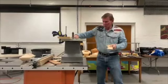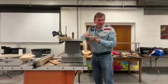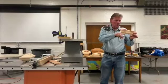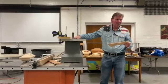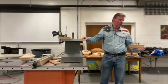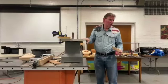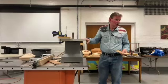Just close. Once you set this, I usually set it a little more than a tenth away to give myself a 16th of an inch cut in. It squares yourself off, rounds your corners beautifully. You're ready to make your legs. Quick and easy. If you have an oscillating sander, beautiful. If you have a drill press, just set yourself a block of wood over the drill, put a disc into it, a roll into it, and cut away.